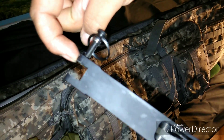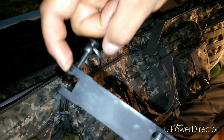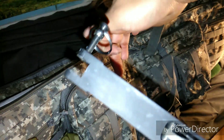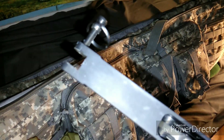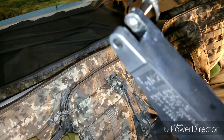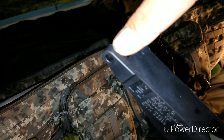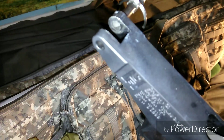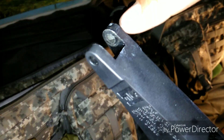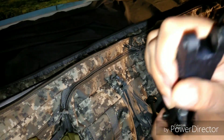So in order to put the lower on, I marked the pin to be flush there. Then I used a Dremel with a cutting disc and lopped off the majority of the pin. Because I wanted a very precise fit — as close to flush as possible — because the closer to flush I have it here, the further in to this side it goes and the more metal I have locking together.